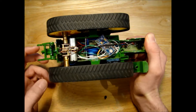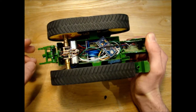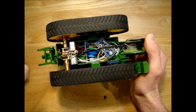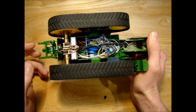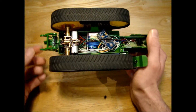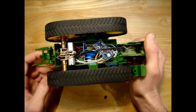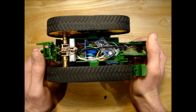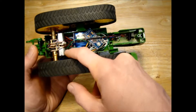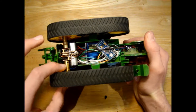When we're looking at motors on sites like eBay, the figure we really want to know is the stall torque for a given voltage. You're usually looking for a stall torque at around about 3 volts because your battery is usually 3.7 volts and you're going to lose a little bit through the motor driver, so you're probably getting around about 3 volts on the motors roughly. That stall torque figure is the torque at which the motor can't push anymore — when you have absolutely maxed out the motor. A motor like this N20 gear motor has metal gears, and that hopefully means you'd be able to reach the stall torque without damaging the gear train. Some plastic motors might get to the stall torque but the gear train might disintegrate. What you really want is for the motor to reach a point it just can't push anymore without damaging your gearbox.